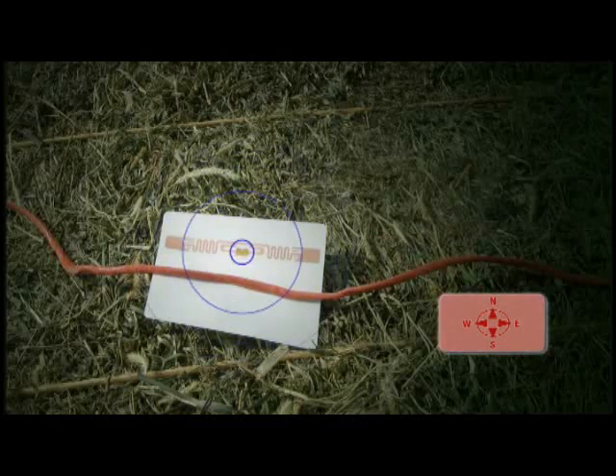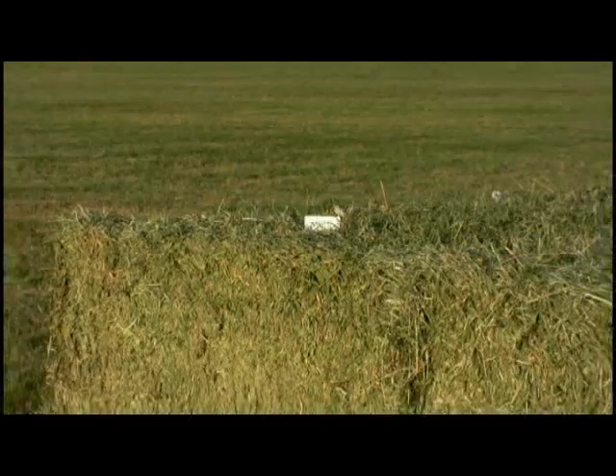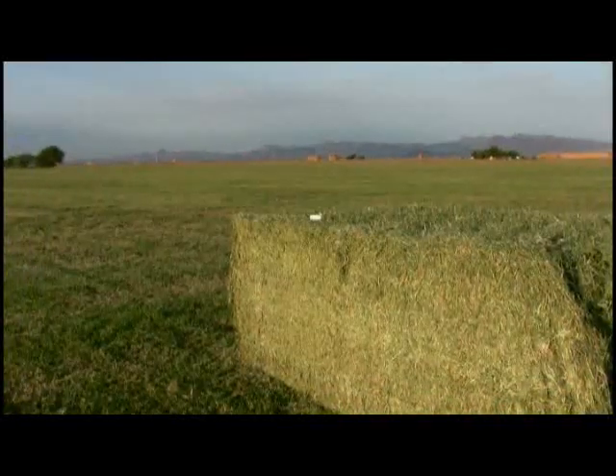Field position: the tagger will also take a position from a GPS receiver and write the field position to the tag for where the bale was dropped. That will help you keep track of where the bale came from and the position. Weight and moisture information can be taken off the unit and is compatible with most yield mapping programs if you want to map the yield of your hay fields. Yes, all of that information is on the tag. You can't see it, but it's there.